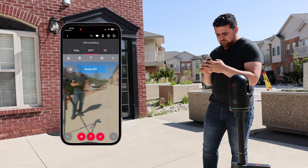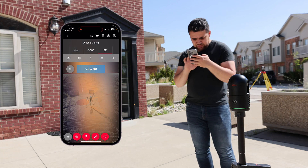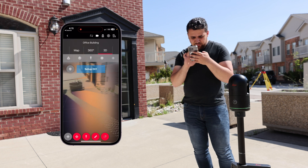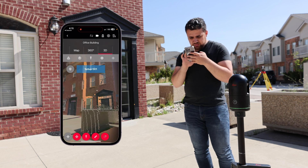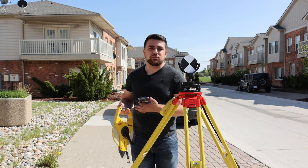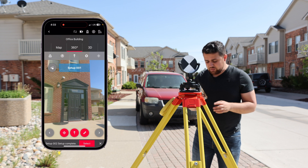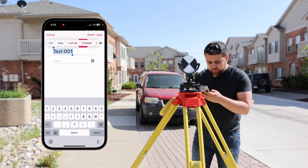Clicking the 360 view shows the panoramic image taken by all of the cameras onboard the BLK360, and 3D mode lets me see the LiDAR scan — it looks really nice. We can see the target at point number two and the target at point number one. Now one thing I like to do is annotate in the scan the targets and their heights on the tripod. This makes it a lot easier in Register 360 when identifying the positions of these targets with the coordinates we collected on the total station. I'll select the annotate text icon.